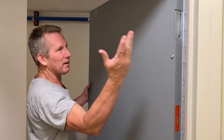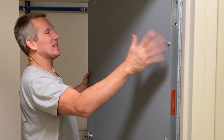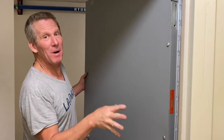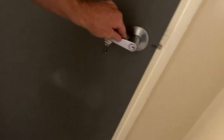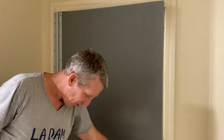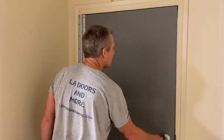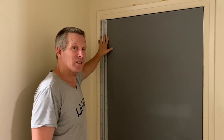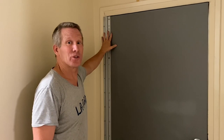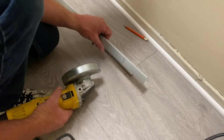Sometimes for whatever reason you'll find you can't get all the through bolts in there — we've got six and that's plenty; three would be my minimum. With all the through bolts in there, we put our lock in. Everything is working perfectly — we have nice even gaps, there is no binding, no scraping of any kind. The last step is to cover these up. These come with covers, and once the covers go on, they do not come off without destroying them. So make sure you are good to go. Since I cut the hinge, you're going to have to cut the covers.